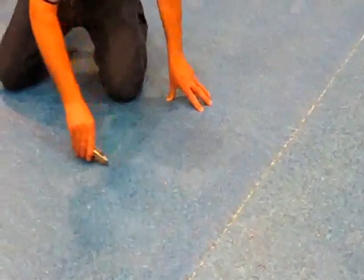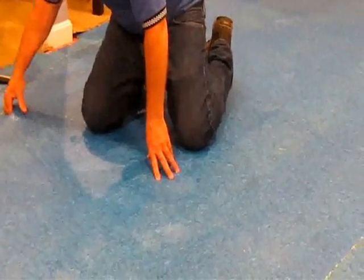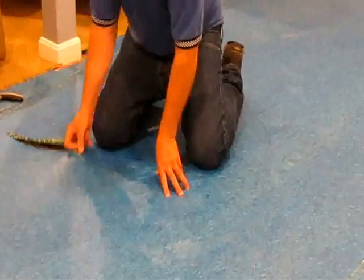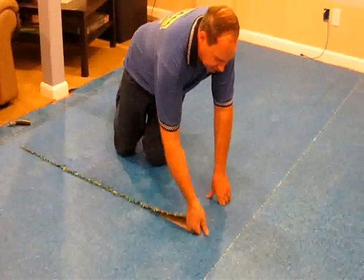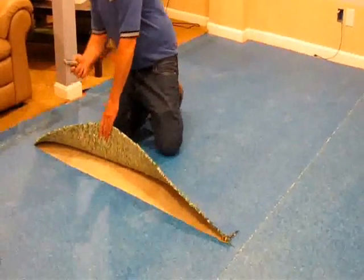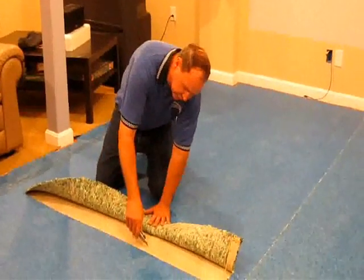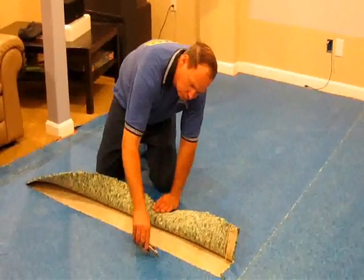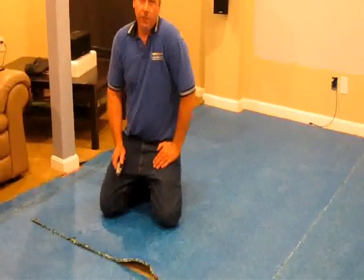So I'm going to demonstrate by just dragging it like that all the way across to the other side. And then just with my hand — you can see it's not really cut free, but it's kind of breaking to where I made the cut. It may not work perfectly, but it's going to go a lot faster when you pull the pad up. The blade can cut a lot further with this method than if you press down — it's just going to hit the concrete, get dull, and you're just going to get frustrated. So only cut about halfway through and hold the blade low, and that will help you cut the pad a lot easier than any other method.